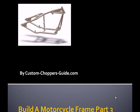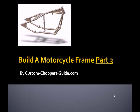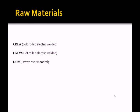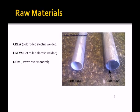The main frame component is tubing. Tubing is measured by its size on the outside, so 1.25-inch tubing has an outer diameter of 1.25 inches. Piping, on the other hand, used for plumbing, is measured by the inside size. So a 1.25-inch piece of pipe would be fatter than similarly labeled tubing. Frames can be made of piping, but it's very bad — they end up very heavy, and the material is wrong for the job. Don't confuse massive weight with strength.